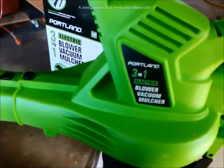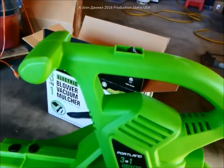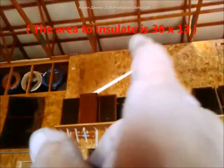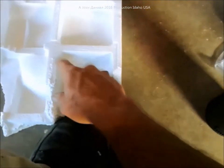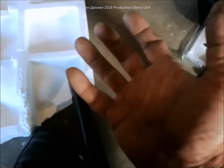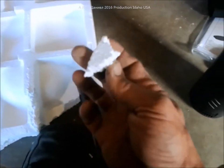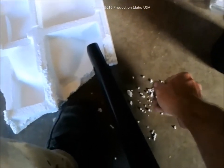I've got an area that is about 36 feet wide inside and 42 feet north to south in my shop, and this whole area up here will have shredded styrofoam blown in. To get it into small pieces — lawnmower. I tried it once with a bagger lawnmower, dropped panels over the top, and it filled a big lawn bag completely full. But the pieces were too large with too many air gaps. You need it shredded finer so it settles down and makes a proper insulation bed.